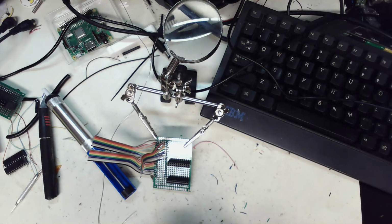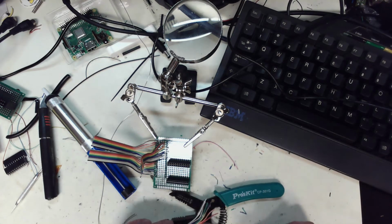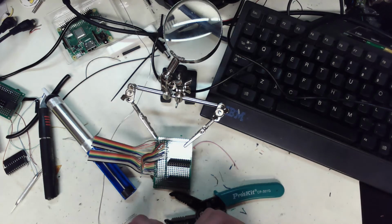And then on top of that, in the wings, it inspired me to investigate the 5200 controls a little bit more. I've had some requests for adding potentiometers on there. I also want to look into, because right now it's a pure digital control, adding some capacitance in that circuit just to kind of emulate the lag of the original control joystick.